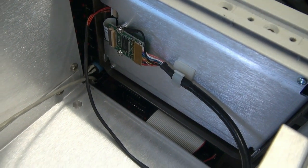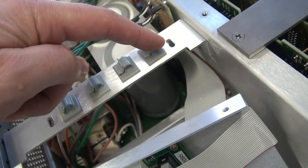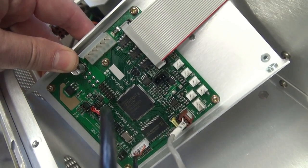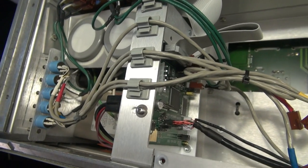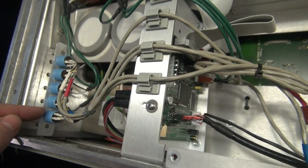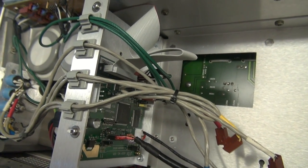There's the LCD board installed on the front. Around to the rear, here's the control board which will screw into the same location as the back of the original CRT. I've already started hooking up some of the connectors — everything is very straightforward and very well labeled. Our wiring is complete. Of the old rear controls you're only going to use one, which is the focus, and you'll use the front panel intensity. The rest are abandoned — the new board takes care of all that.